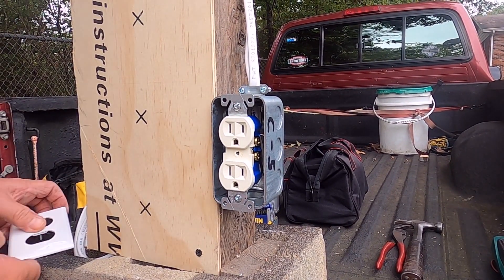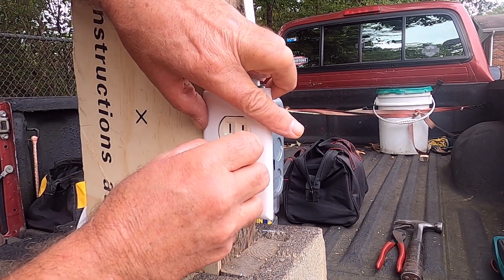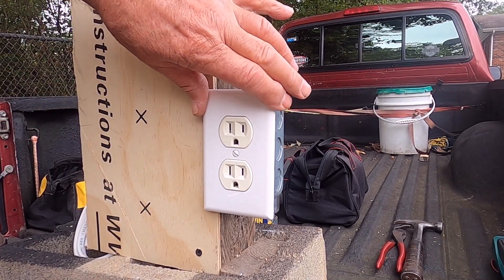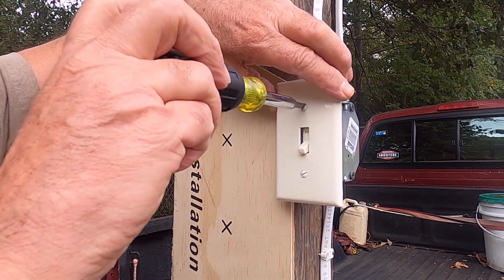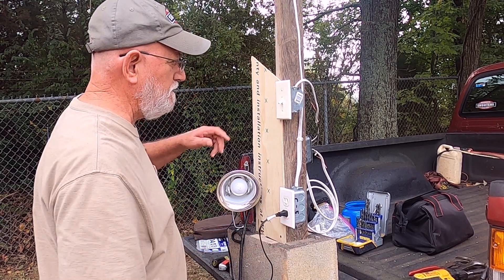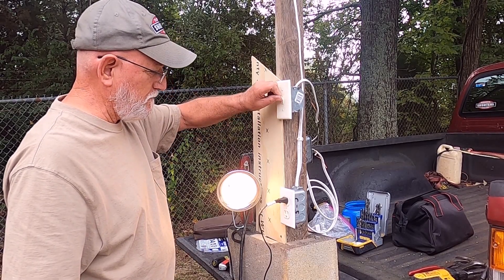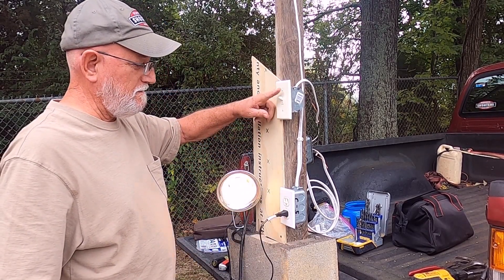This is not the right color plate, but it'll give you a good enough idea of what it's supposed to look like. Now we'll put a light switch cover on the top here. Now let's see what we got — gonna plug in the bottom here, a light switch, see if it works. We got lights — that's good. Now let's see if our plug-in's hot all the time. Yes sir, plug-in stays hot no matter what the light switch does. You come home, it's dark, you hit your light, a lamp comes on. Look at that.